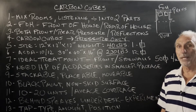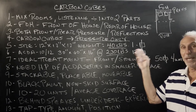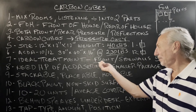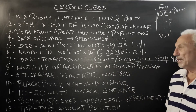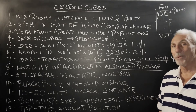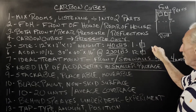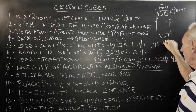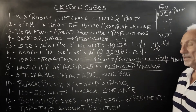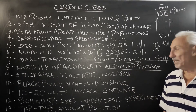These are much bigger performers per square foot — up about 20 points. So you get a lot of performance in a small box. With the ACDA series at 12 square feet, we get about 0.75 dB attenuation. These are about 0.5 dB attenuation per unit, giving a lot more horsepower than the ACDA in a smaller form.